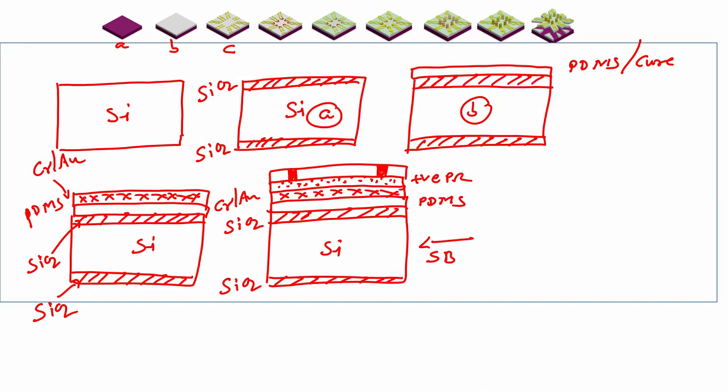Because we have to have these gold pads or contacts that can help us to measure the change in the resistance from the piezoresistive sensor. That is what I meant by my earlier sentence, to obtain piezoresistive sensor is to understand the change in the piezoresistivity of the sensor with the help of gold pad. These are contact pads, okay. So this is bright field mask, I will do the lithography, so I will go for the UV, after UV exposure I will go for photoresist developer.